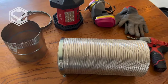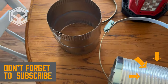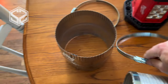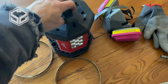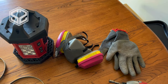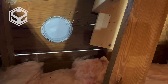We're done outside. Let's go inside and get ready for the attic. You're going to need a flex hose that extends up to 10 or 15 feet, a few hose clamps that clamp down onto the hose and hold it in place, and a coupling to connect the old hose with the new one. I also have a light — very helpful when you're going in the attic since it's dark up there — a mask and some gloves. I'm also recommending pants and long sleeves to keep the insulation from bothering you. I'm going to bring up my drill again for the hose clamps, and that should be it.